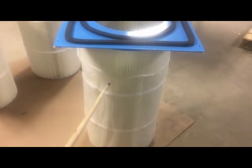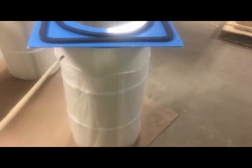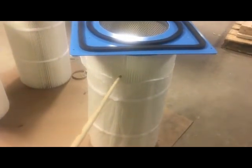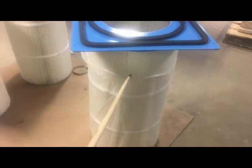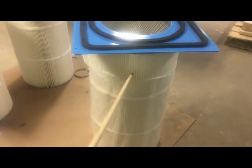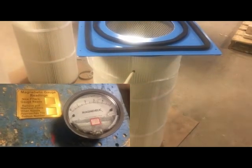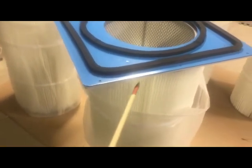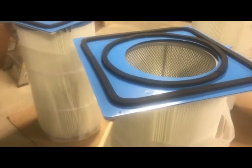That way, whenever you turn the machine on, the only air that it's going to get is right across the top here on both filters. And that will be a very close resemblance of your filter being about 2/3 plugged up. And that will give you the reading on the Magnehelic gauge of where you need to set on the sticker, and I'll show you the picture of the sticker here in a little bit, of where you have to set your numbers. So now we will set the filters inside the machine so you can see what that looks like. These are the filter caps, and there's a piece of plastic that is fastened underneath here that slides on top of the pipe, and that's what makes it very slick to slide in. Now he's going to place the filters in.